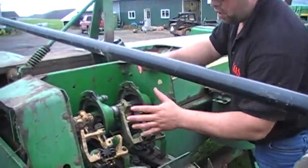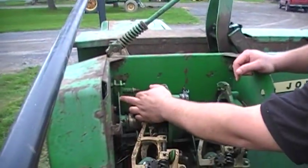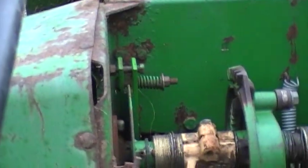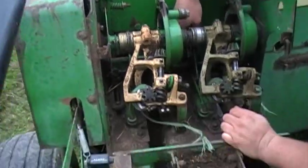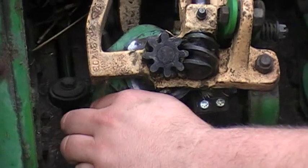Make sure your brake shoes are good. This is a 6-series baler — on the 7-series, the brakes will be on the side. This one has two new-style knotter halves in it. Tuck your fingers and make sure everything moves and functions freely. These are quite worn — not real bad, but they're worn.